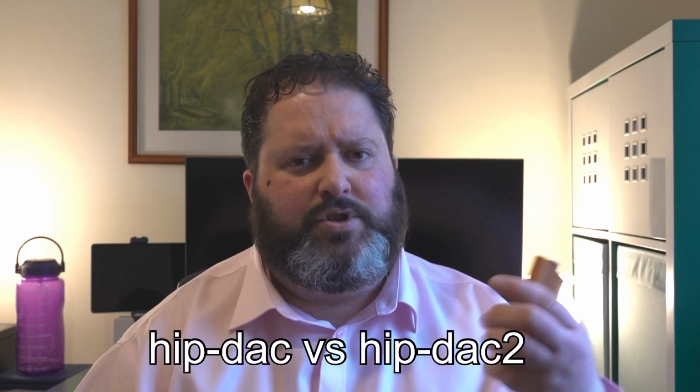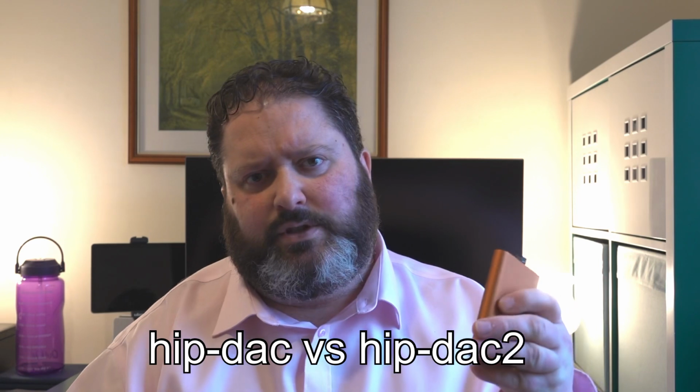So you might be interested what's changed from the original to this. Well, it does full MQA decoding, if that's your thing. It also has an upgraded crystal clock that eradicates jitter. That's digital distortion, and that makes a lot of difference in the sound quality. It also has a new XMOS microcontroller as well, which enhances the overall power this actually puts out. It's got a new 16 core IC, which delivers double the clock speed, which is 2000 MIPS, and has 4 times the memory at 512 kilobytes, as well as the latest super speed standards.